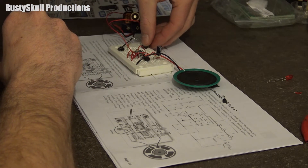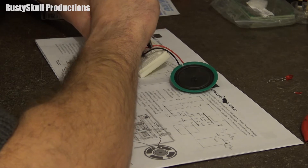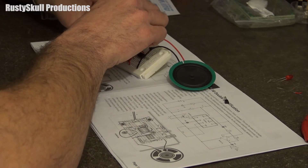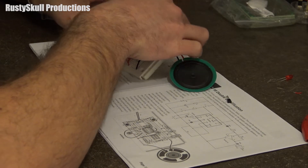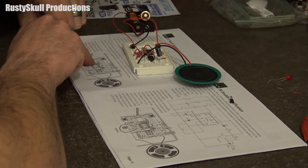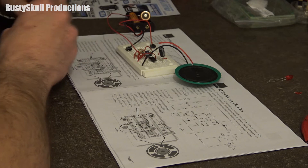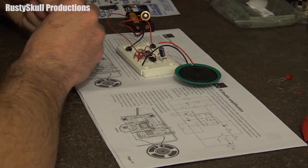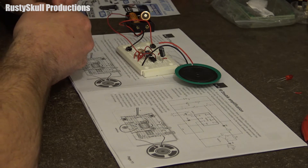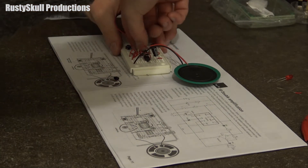That's how it's supposed to be but they're not long enough and not really going in very far. Switches are in, resistor is in. Now we put our BC557 in — it's got to go that way by the looks of things, so we spread out the connections a little way. I've got to take this resistor out and reorder.